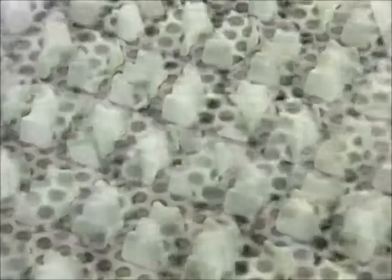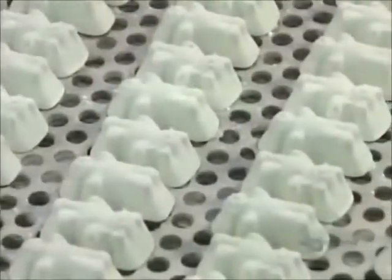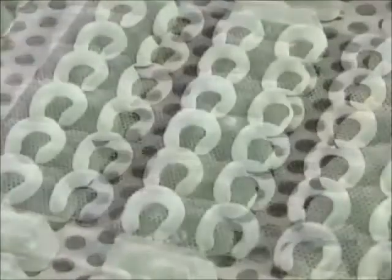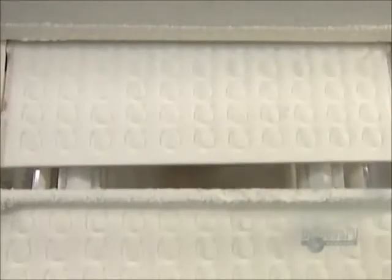Gummy candies. They use what are called printing boards, large sheets with raised shapes. To make gummy worms, for example, they mount the gummy worm board on a stamping machine. The machine then stamps the worm shapes onto trays of cornstarch. This creates a series of cornstarch molds for the gummy worms.